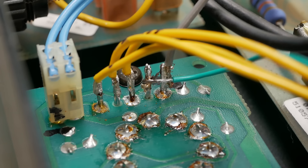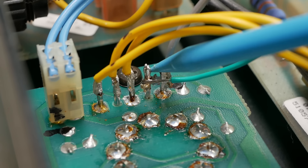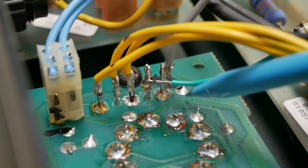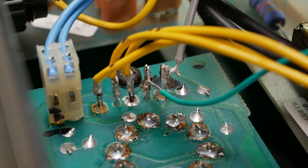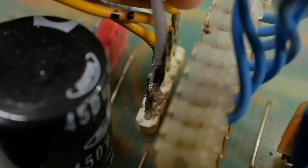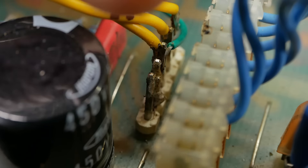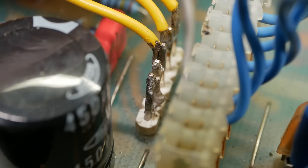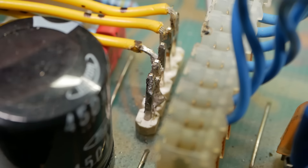That wire's barely soldered — it's just slightly wetted with solder and tacked on. That's not how you do business. That wire came off with barely two fingers — not reliable at all. All of these headers are tack-soldered and just peel off. The replacement transformer secondaries have been spliced onto the existing wires, probably to avoid replacing the spade connectors at the other end. Splicing is valid as long as you do it right — but looking at the rest of the work on this amp, I'm going to remove the heat shrink on every splice and check integrity before it leaves here.